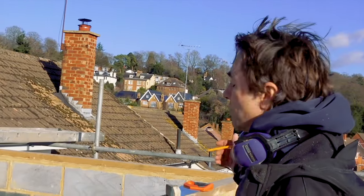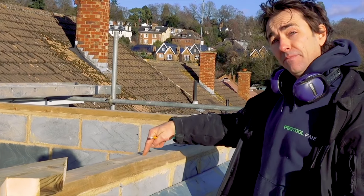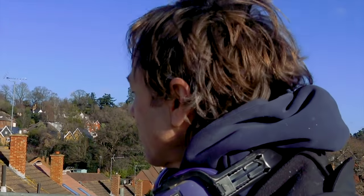If they were any longer you wouldn't be able to do that, because as soon as you put the rafters on they want to push the walls apart — so it's really dangerous. What you do then is put temporary ceiling joists across to hold the walls and the wall plates. We haven't got to worry about that too much because this span is only just over four and a half meters, so the rafters are only covering a run of about two point two meters. We split this end — where the hip is — in two, marking the center for our first pair of common rafters. It's all got to be equal, forming a pyramid. We've taken those marks down the flanks and we're ready now to position the rafters, which have all been worked out for this roof at 33 and a half degrees precisely.